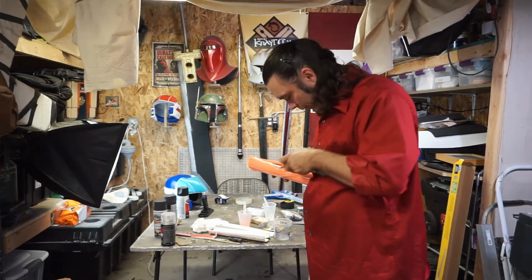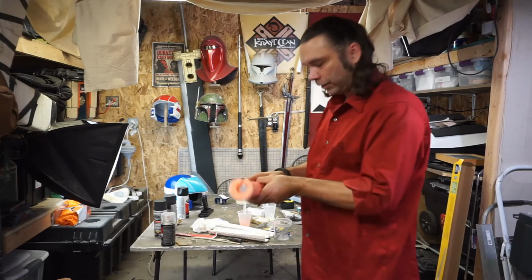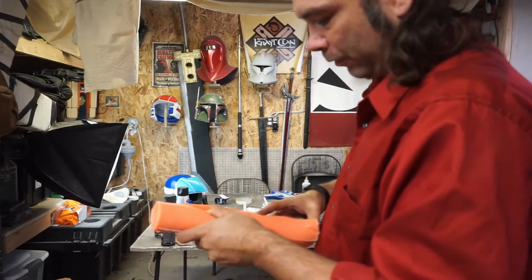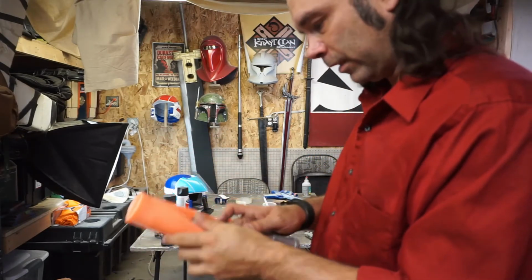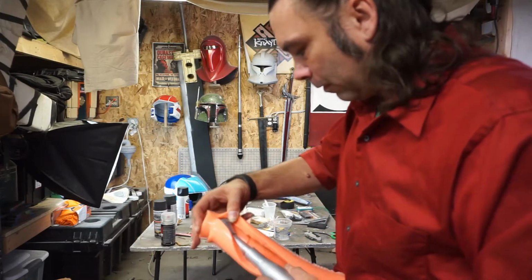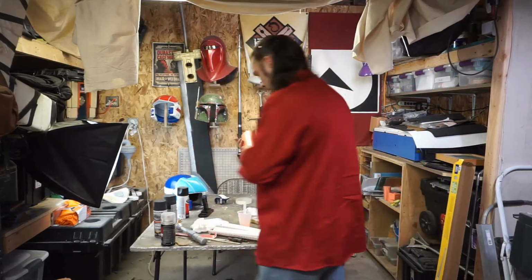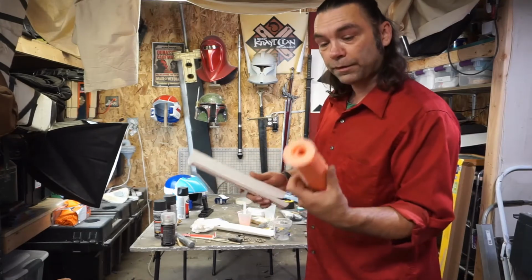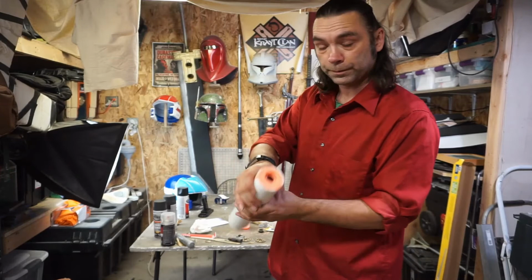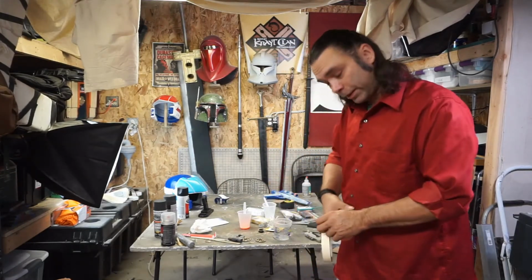If you make a lot of lightsabers, this is a process you're going to get familiar with. So I took my cut just to the edge there, as I should be able to pop the whole thing out. I'm not trying to force it. Let it come out nice and easy. Alright, now these registration marks. All I have to do is reline everything up. They should be ready to pour a mold, which is what we're about to do as soon as I tape this back closed. I'm probably going to pull 2 of these real quick.